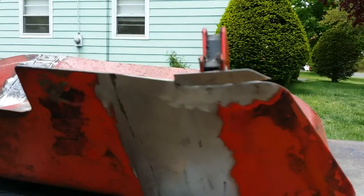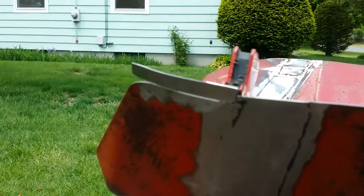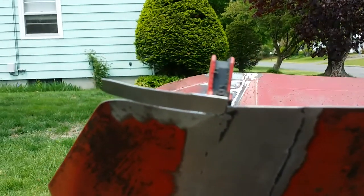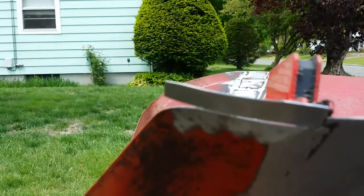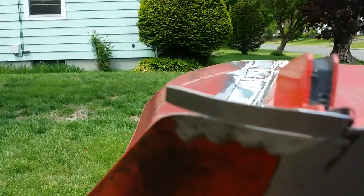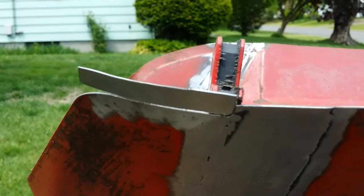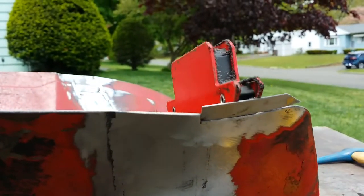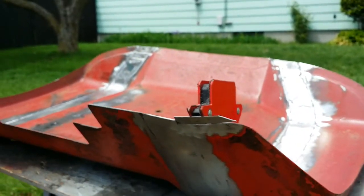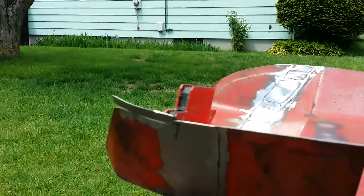So I have the little patches loosely affixed in place by magnets, and what I'm going to do is tack them into place. Next I'll drop a line for the arc and then I'll either cut this off with the tin snips a little bit and then go in there with the air sander and bring it into shape. Let me go ahead and get those tacks into place, get these magnets out of the way and then we'll see what kind of damage I did.